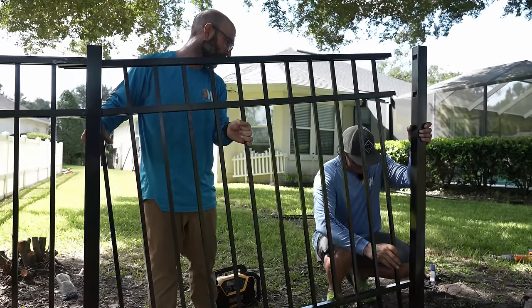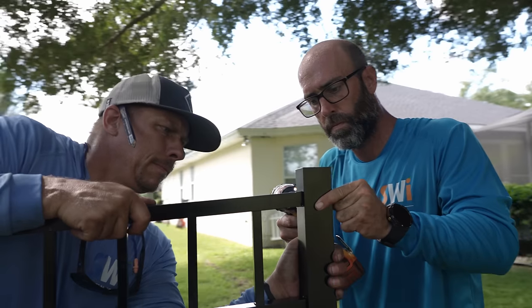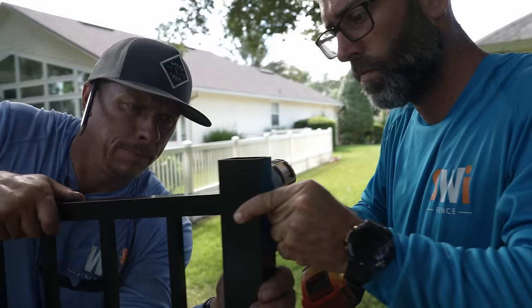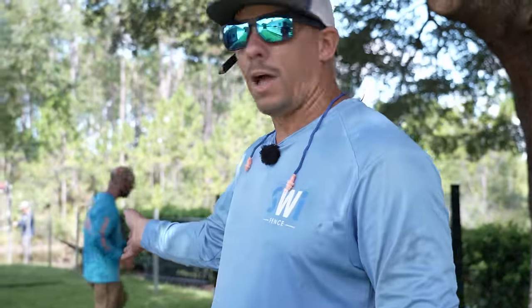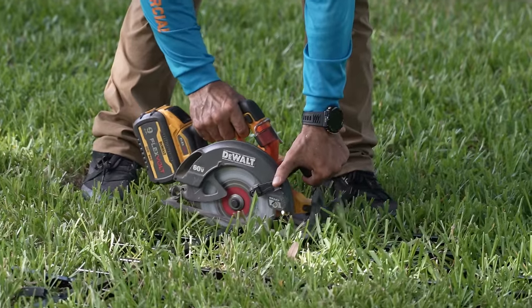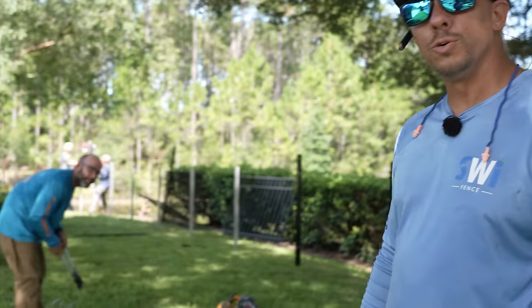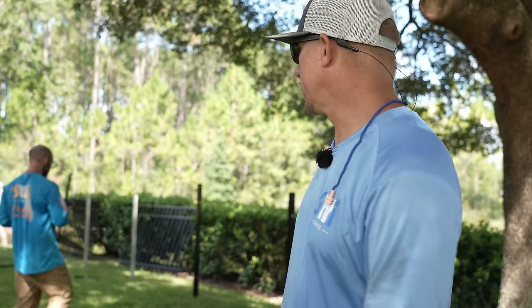Very carefully, because those are sharp and we don't want to scratch up our posts. If you'll notice, Brian — when he's cutting — he's setting the saw down on top of the cut rather than sliding it through. The reason we do that is because it'll pick up little shavings of aluminum and scratch the heck out of whatever's underneath the shoe. So he's just lowering it down to cut all the way through rather than lowering it and then sliding it — we're just trying to prevent damage to the material.